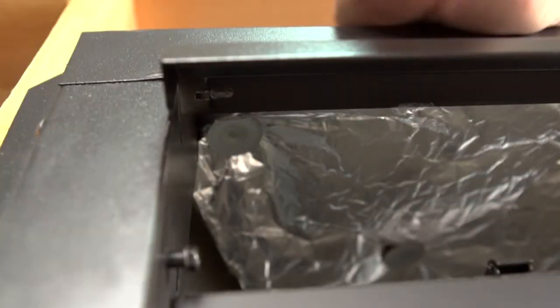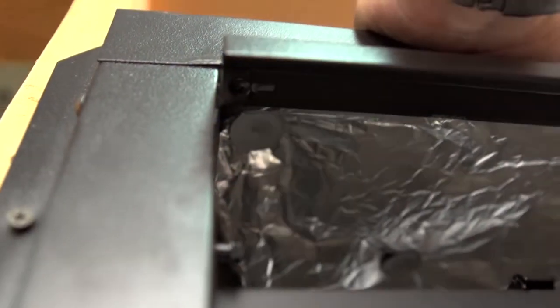Slide the hood below the upper face frame and align mounting holes of the hood with the holes on the face frame. Secure with 3 half-inch screws provided. The clean face screen will hang on the 2 shoulder screws.